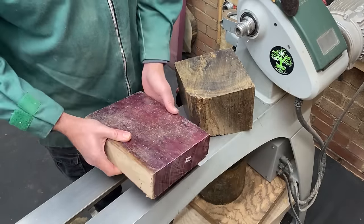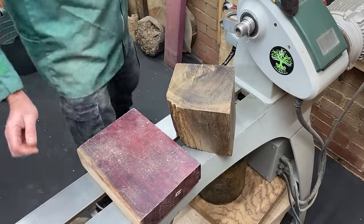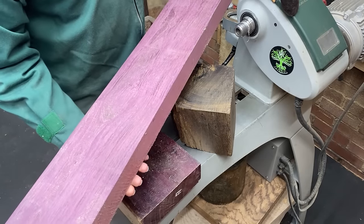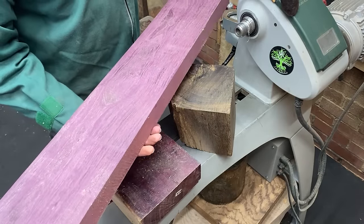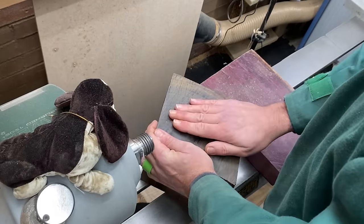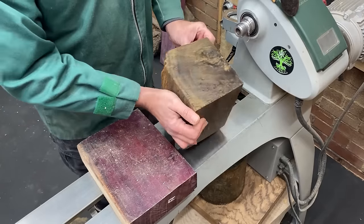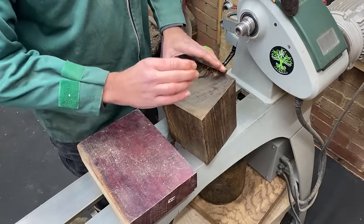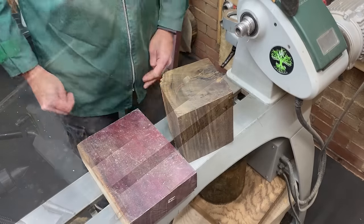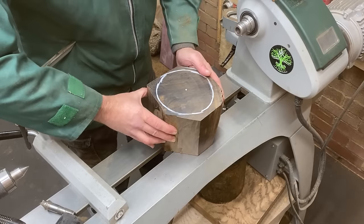Now if this piece of Purple Heart isn't long enough — and I won't know that until I've created the full shape on the mallet — I do have another nice long piece of beautiful Purple Heart as well, but I prefer to cut off that scrap first. I think first things first I will get out my mitre saw and just try and take off a couple of these corners just to make it easier to turn. This is quite a notoriously hard wood to turn, so to give myself a bit of a break I'm going to see if I can cut off these corners first. Okay, not the most amazing cuts in the world but it's slightly rounder, so that should hopefully make our life a little bit easier.